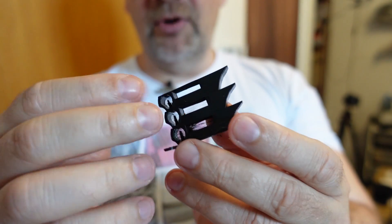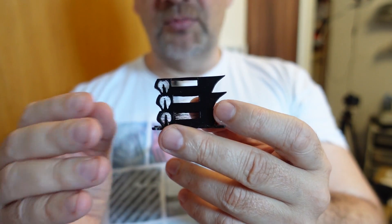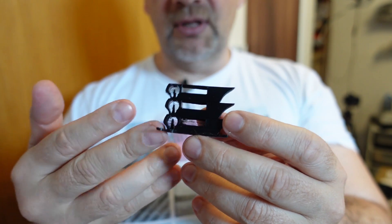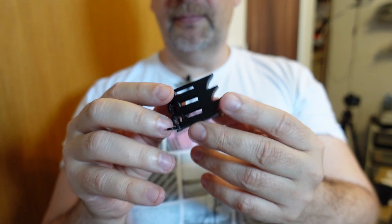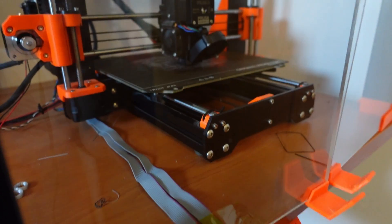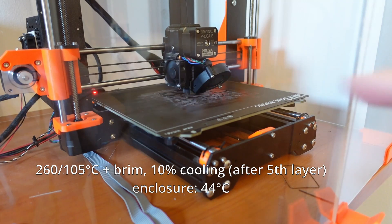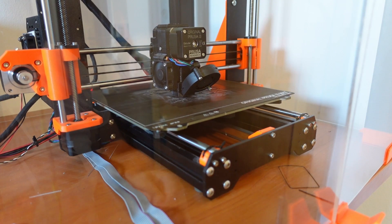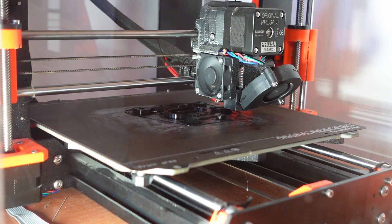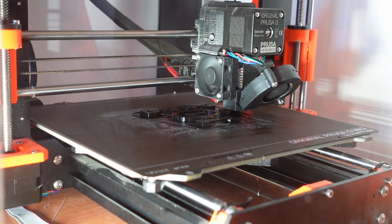Perfect overhang and bridging even with only 10% cooling. I know I will have problems with my test objects because they are completely solid, which is much harder to print if the material tends to warp. I decided to print test objects in two groups. I raised the bed temperature to 105 degrees Celsius and used a brim, which is already printed so the first layer looks okay. Current Z-coordinate is 4.2 mm and most of the test objects are printed — each of them is perfectly straight, which is very promising.